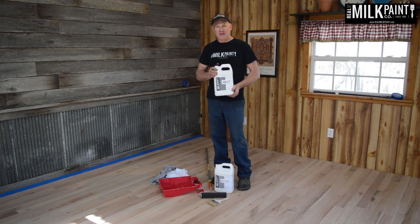We're going to go back and forth a couple more times. You can still see it's laying pretty heavy here. Once we back our way out of the room, you can walk back over it and roll on another coat. We'll probably get two or three coats today, and then we'll be done for the day. At that point, you're going to wipe up the excess with that t-shirt material — down on your hands and knees, ice skating around to pick up any puddles. Give the tung oil about 40 minutes to an hour minimum to soak in. You can let it sit an hour or two, but give it at least that 40-minute time. You just don't want to let puddles sit overnight.